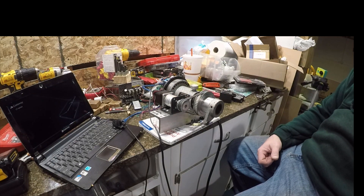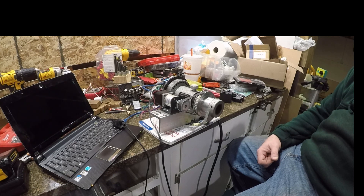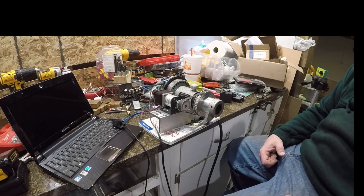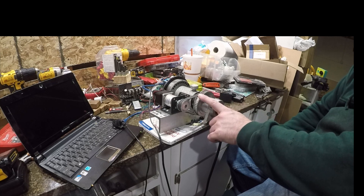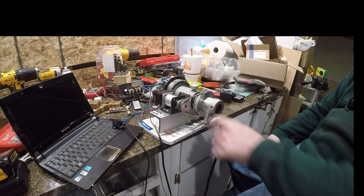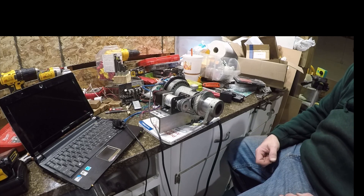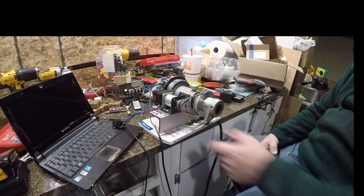Why 100 to 1? Isn't that going to be really slow? Yep. Is it going to be a lot of torque? Yep. Both of those are to your favor when you're cutting a gear — especially a large gear, you want to really be in control. The belt I used on this one is an XL type — they're smaller belts but I like the size. The sprockets are available on Amazon or eBay.